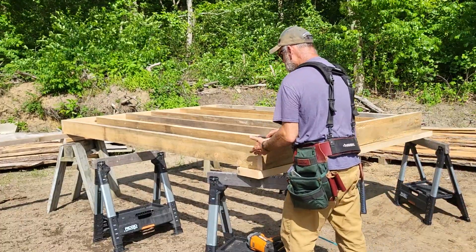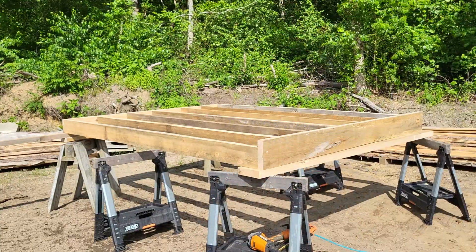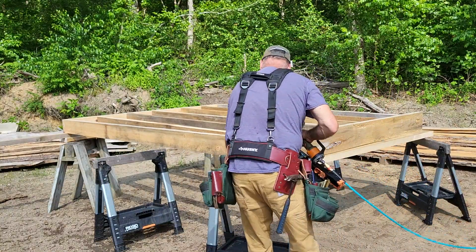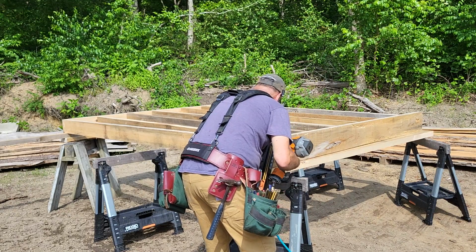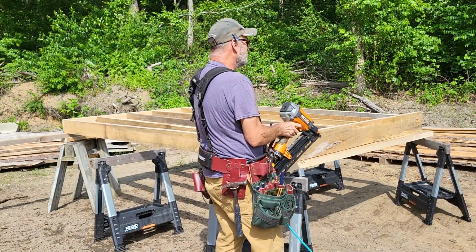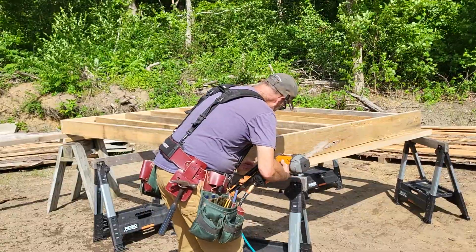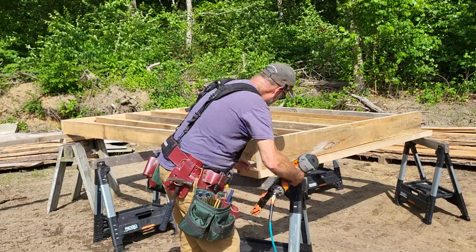And what I'm going to do is we're going to shoot this whole side, then we'll go over there. We'll shoot that whole side. That's simple. Make sure you get a good view. Like I said, I'm shooting them with 3 1/4. All I'm going to do is hold them up, line them up. I know you're seeing my back. Oh, I got a multi-shot here. Don't want multi-shot right now. Just square it off the side. I'm going to shoot these high and low because I'm going to put a timber lock through the middle, through both edge joists at the end.